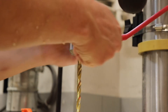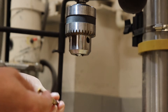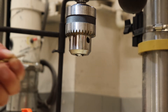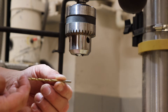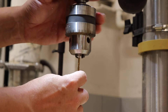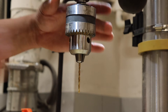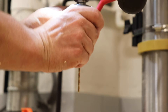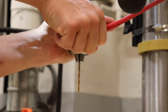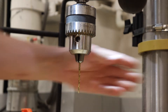Let's take a closer look at the operation of the drill press chuck. You can see the key being inserted to unlock the drill press and I'm hand-loosening to remove the bit. Now I'm going to put in a new smaller bit. I want to grab onto the solid part of the drill bit and never grab onto the twisty part of the bit. I'm twisting the handle of the chuck down to grab on with the three fingers of the chuck. I'll hand-tighten and then grab the chuck key and do a final tightening to make sure that my bit is securely locked into the chuck. Check it with my fingers and now I'm ready to work.